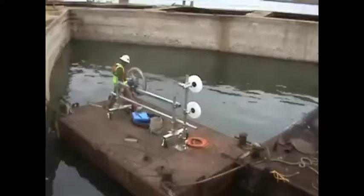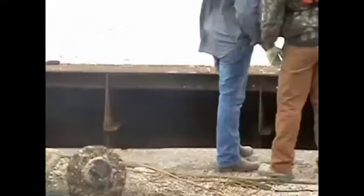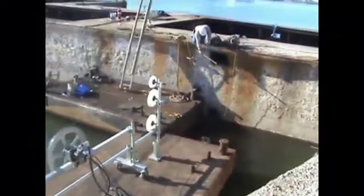We set this wire saw up on stages of several pulleys, so we don't have to cut the wire. The wire is pulled steady throughout the vessel until it's cut all the way through it. As we pulled it through, we had to adjust the pulleys up and down so we can keep the 100 feet of wire in one continuous pull without cutting or splicing the wire back. The wire lasted one continuous piece throughout the pull.